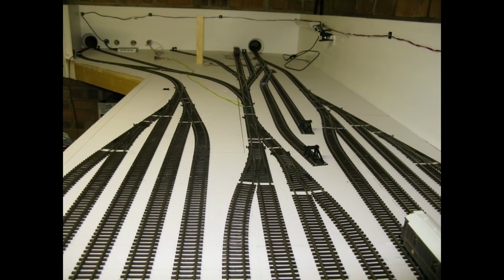And just in front of that lamp that you can see is the first attempt at cameras. What you've got there is a USB camera which conveniently had a clamp on the bottom of it, which I was experimenting with to see whether I could put 6 USB cameras in there. That really isn't possible unless you've got an incredibly powerful PC that can look at all the cameras at once and keep them all connected.